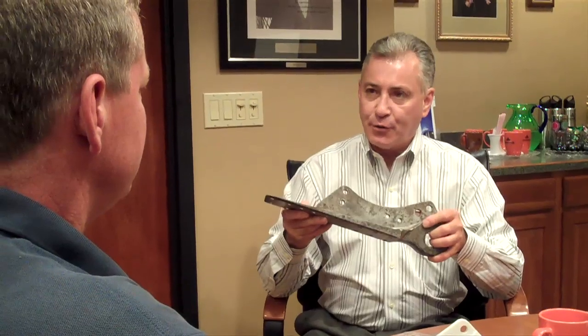Let me introduce you to Soleil Standard, our materials engineer. Hi Craig. Hi Soleil, nice to meet you. This is a forging — an original forging, upper hinge for the F4U Corsair, which holds the wing onto the center section of the aircraft. It's in very good shape except for a few flawed areas, and we're hoping there might be a way we could salvage that part through some of your processes here at Joining Technologies.